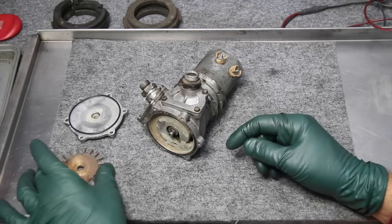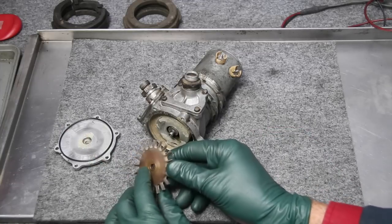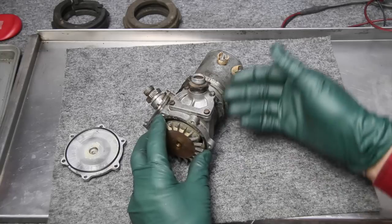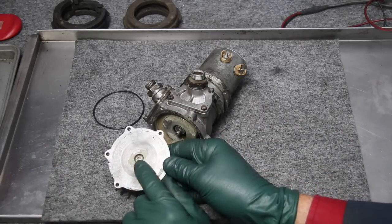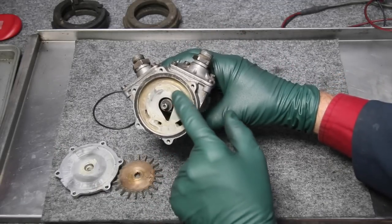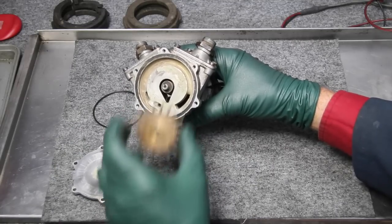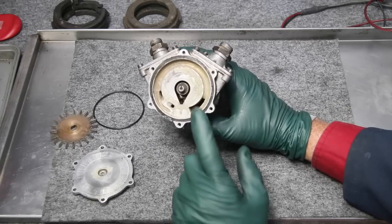The other problem is this impeller has a very tight clearance to this surface and the bottom plate. If you've looked at my other video on the Beast — the 6.3 — when I took the pump apart it had a lot of varnish buildup in here, and the varnish was making the impeller stick and preventing the motor from spinning up. In this case I didn't have varnish, but I have some — it's almost like a calcified material — both on this bottom plate and right here. You can feel it; I rub my finger across there and it's thick. It's obvious that with this impeller in here and the plate bolted on tight, there was so much friction that the motor could not spin the impeller. All I'm going to have to do is clean this up.